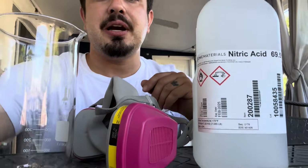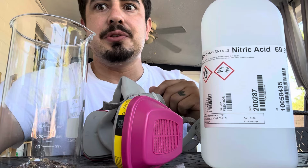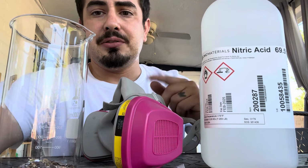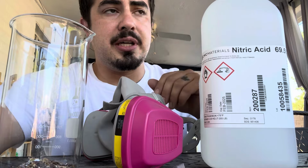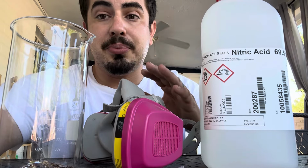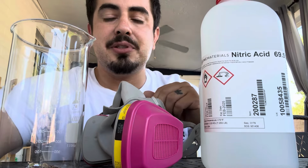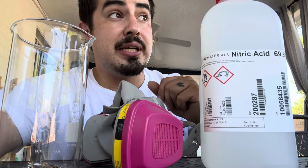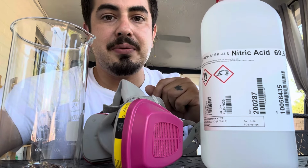It is very hot. It's about 110 degrees out back today. So my phone will overheat if I leave it on a full time lapse for a while. So what I'll do is I'll dump this nitric acid and distilled water in here, cover it, cook it, and we'll do those boils until there is no fume production and no color indicated from dissolving this material. So we're gonna get on the hot plate, start cooking this stuff up, and we'll catch up with you when we get through this process.